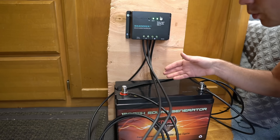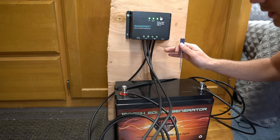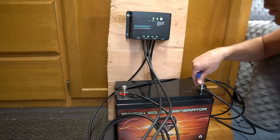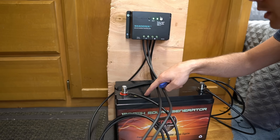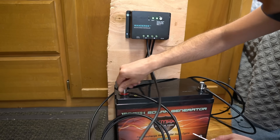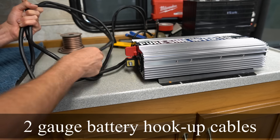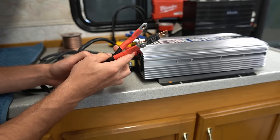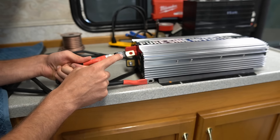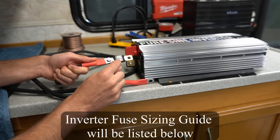The battery is now charging, but we want to add an inverter so we can use the stored power to run our appliances. Before working on the battery wiring, remove one of the solar panel cables from the charge controller first — any time you mess with the wires between the charge controller and the battery, remove a solar panel cable first. This is our inverter, and we'll use battery hookup cables — one red for positive and one black for negative. I strongly recommend buying a bolt-on fuse from an automotive parts store. For a 1500 watt pure sine wave inverter, a 175 amp fuse works really well.